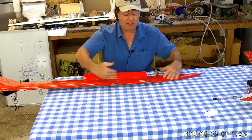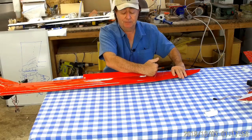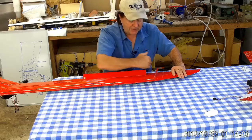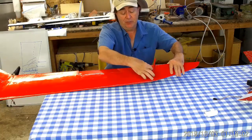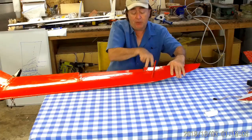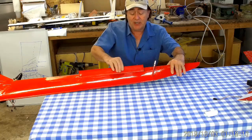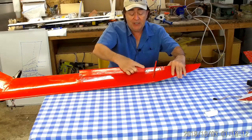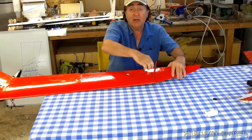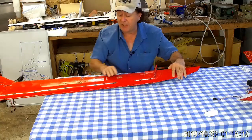And it goes back straight. In fact, that's what I'm doing with this open section right here — it keeps the flow going straight, right up against the fence and winglet. You've got flow going straight; elevon comes up and the flow is trying to get out this way, but there is an aerodynamic barrier of flow going this way. All of this helps stop the spanwise flow.